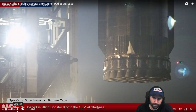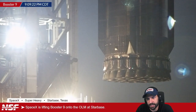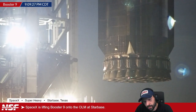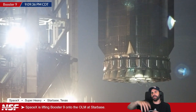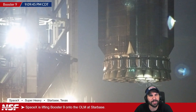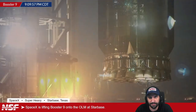But I was thinking about Rocket Lab landing their boosters in the ocean, and they're planning on reusing one of those engines that got dunked in salt water, right? Because Rocket Lab uses electric pump-fed engines, an electric motor moves the liquid fuel and oxidizer into their Rutherford engines, there's way less plumbing. The motor is not nearly as complicated. That's how they can probably get away with something like that. But even then, if I dunked a jet engine or a rocket engine into salt water like that, I would probably take the whole thing apart and put it back together just to be absolutely sure.